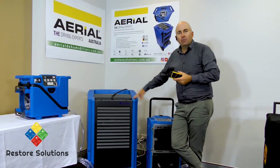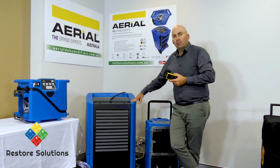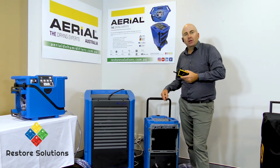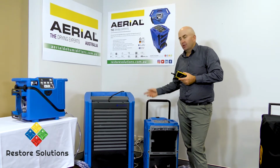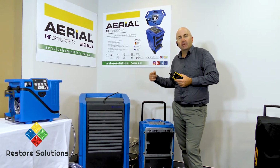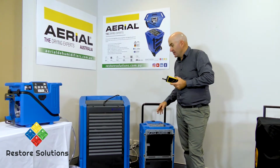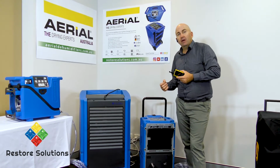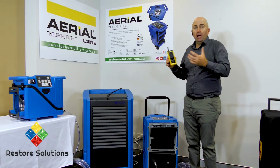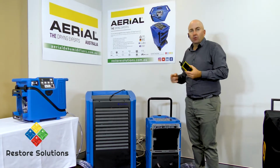At the end of the day, you have a lot higher CFM, like this is 482 CFM. So you've got much higher CFM, and this one's a 320 CFM for such a small unit. Because they use axial fans, you actually change the air more with these units. So it's actually passing through the dehumidifier more times per hour because it has a greater airflow, air exchange capacity on both of these types of dehumidifiers here. So air change is a big key over in Europe. They mostly do axial fans where they can do more air exchange, which is pretty important. So more times for the air to go across the coils, more times they get the water out.